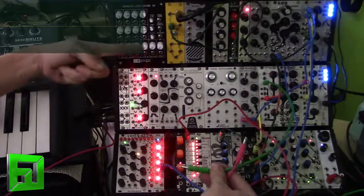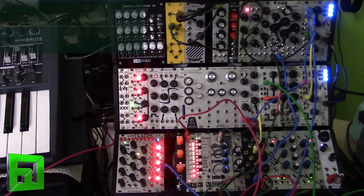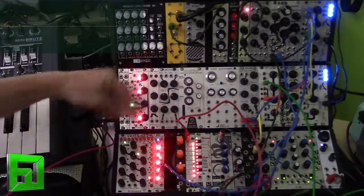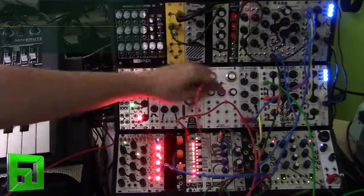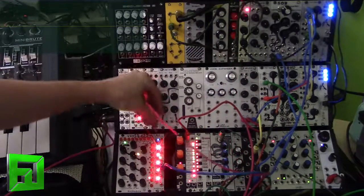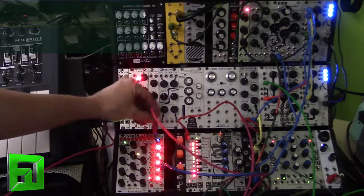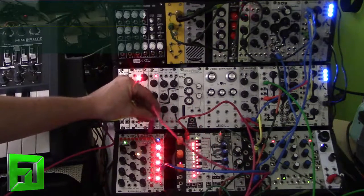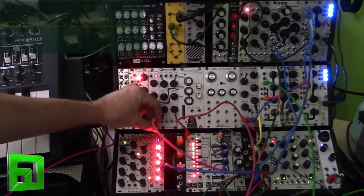What I want to do is show how this thing sounds as a sub-oscillator. The reason I want to do that is different dividers sound different ways when you use them as a sub-oscillator — some are clean, some are dirty, some are really really dirty. So let's check it out. This module does not need a pulse input — anything that's a rising edge of 1.1 volts will work, so you can use an LFO sine wave or whatever you want.